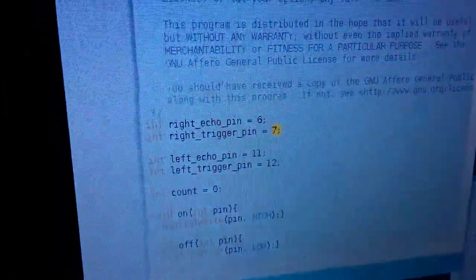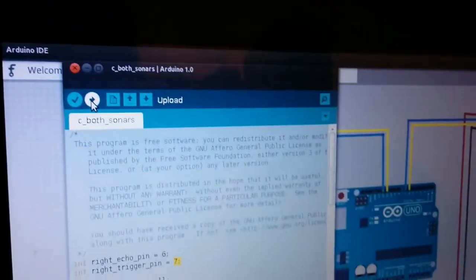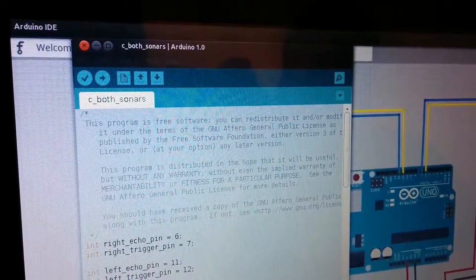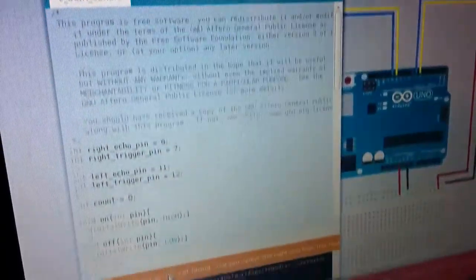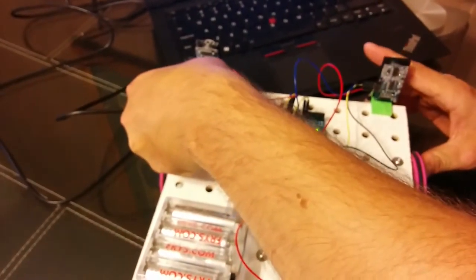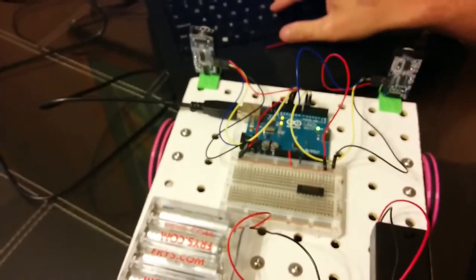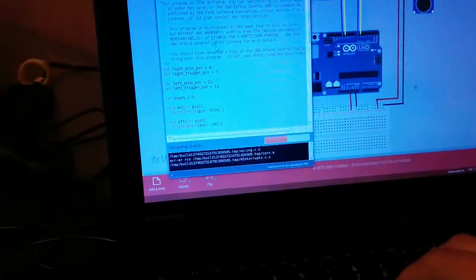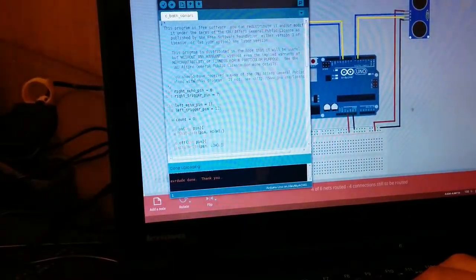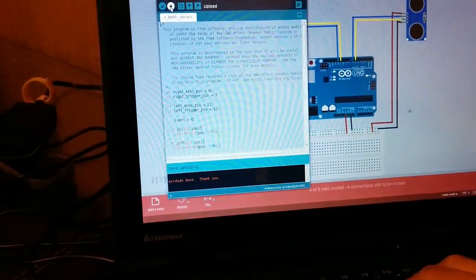And now I will hit the upload button up here, and once it's uploaded, it says serial port /dev/ttyACM not found, because I did not plug it in. That helps with connectivity. Yeah, it's better for communicating when they're physically connected. Okay, so now it's uploading. After I connected with the USB cable, I hit the upload button.